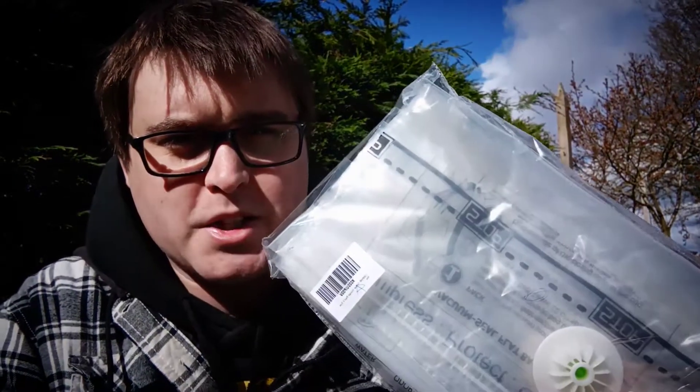I'm trying a method and I'm not sure whether it will work — I'm using household vacuum bags. They may work, they may not. They came with a little pump and so far, testing them, they seem to work pretty well. To try and get the air bubbles out and make sure the resin goes through every part of the mould, I've got these needle rollers. Hopefully they'll do the trick for getting rid of as many air bubbles as possible. And my PVA release agent.